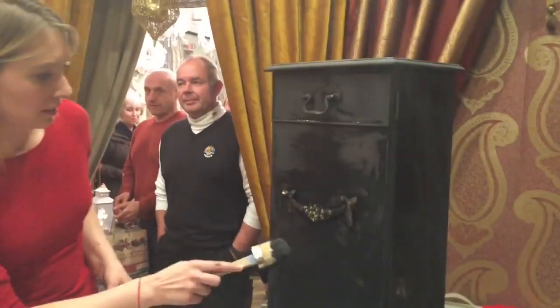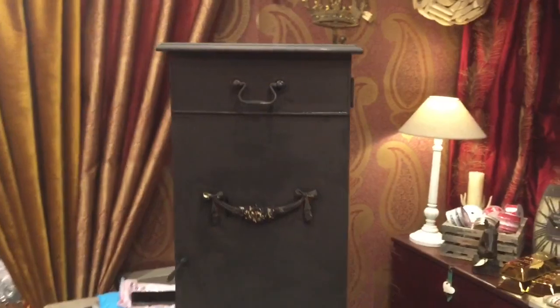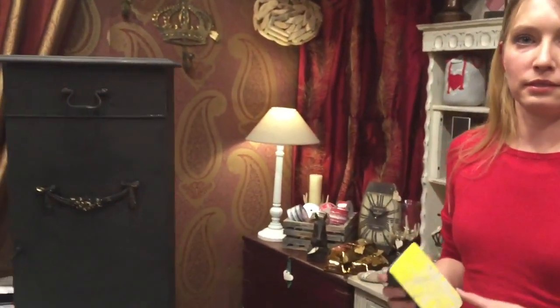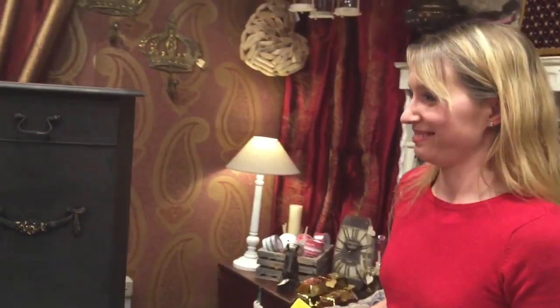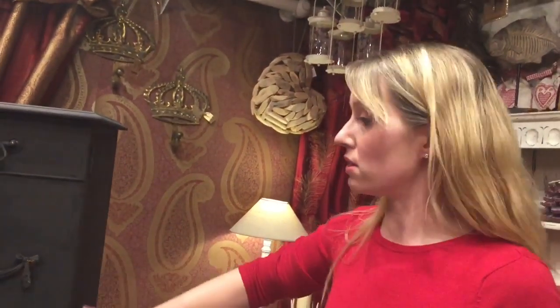It really is starting to dry very quickly. That side must be nearly done. The cabinet is dry now. Ordinarily you would touch it up, but because this is a demonstration we're just going to go for it now. So what exactly are you going to do? First of all I'm going to take my sanding block to it and, as I said earlier, try and get through some of the paint and some of the varnish underneath just to highlight the features and make it look a little bit less manufactured and more like it's been done with love.